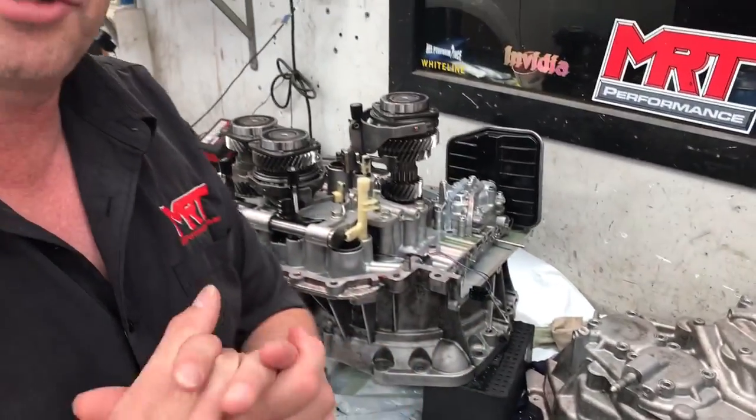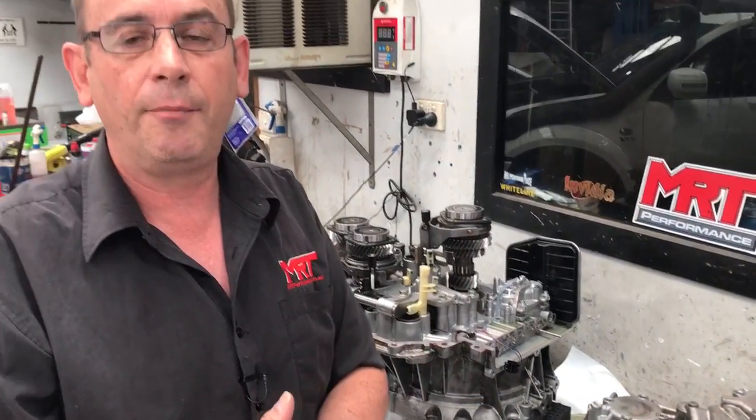What we're going to talk about today is an alternative to replacing the magnets. In the past we've had a lot of success with gluing them, but you may be in a situation where you don't have a reliable jig to locate the magnets that commonly come loose or fall off. Some models do have problems over time depending on the type of glue used. Mitsubishi did actually change the glue in later model transmissions, but it still manifested as a continuing problem — the changed glue didn't solve the problem with the magnet falling off the shift fork.